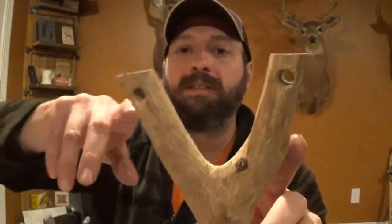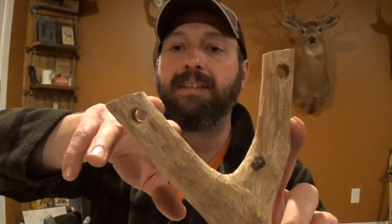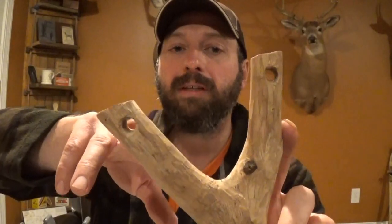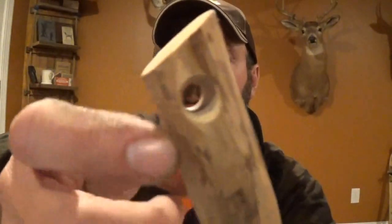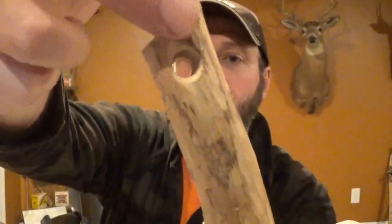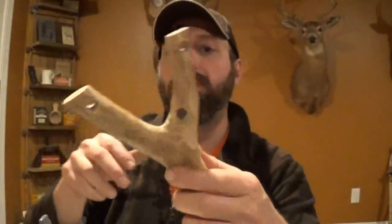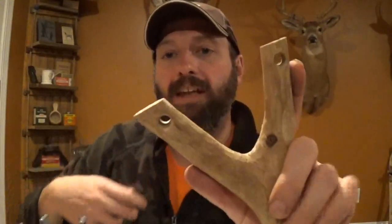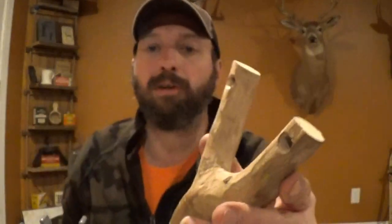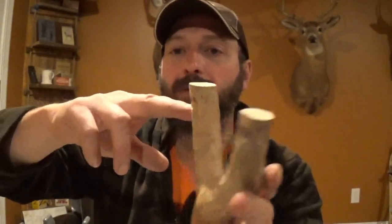When you are deciding to do this, you have to have thick enough forks in your frame that you can thin it down approximately the size of the hole and you've still got enough strength. The key point is it doesn't have to be the exact diameter of the tube — you can be a little bit bigger or a little bit smaller, you've got a little bit to play with. But you also have to have a smooth chamfered end on both sides. You're going to have to take your knife, deburr and knock the edge off both sides of the holes, front and rear, because the rubber is going to be in contact with these holes on both sides.